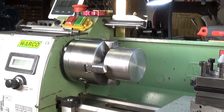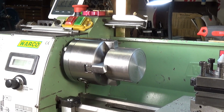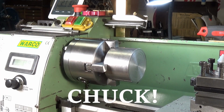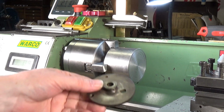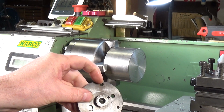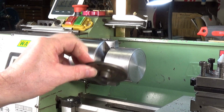Well, in the end, I definitely decided to make a new one of these, the table for the Goodell-Pratt drill press. So to that end, I've got a nice piece of 2 3/4 inch mild steel stock chucked up in the vise, and I'm not going to show you the machining of this. It is very straightforward. Basically, we just turn into a shoulder. We've got to make that boss in the middle. We've got to drill. I might show you the drilling, how I go about drilling this hole and tapping it. But for the most part, this is really bog standard basic machining.